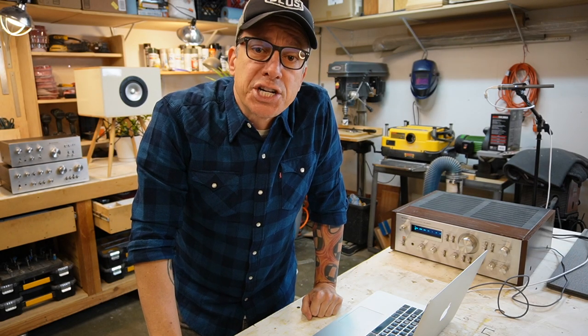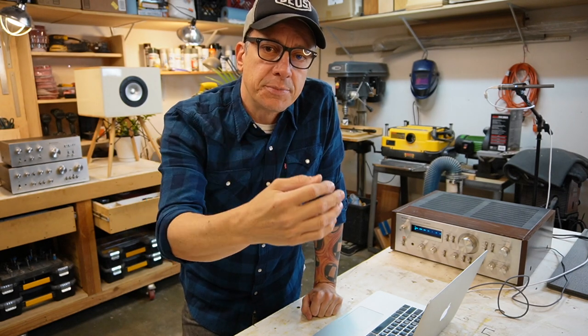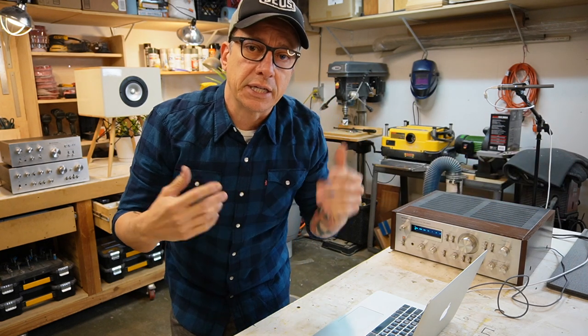We're gonna measure the speakers, we're gonna get the curve, check the points we need to work on, and then we're gonna go to the filters. Let's do it. All right, guys, I set up the whole thing and we're gonna start measuring. So we're gonna get first frequency response, 1 meter distance from the microphone to the speaker. Then I'm gonna do more of a listening position because the sound's gonna change, okay? There is always a sweet spot where you sit at a certain distance from the speakers and you hear it better, especially for bass.